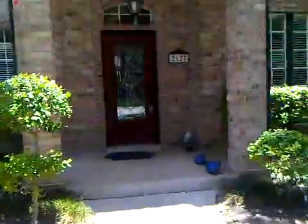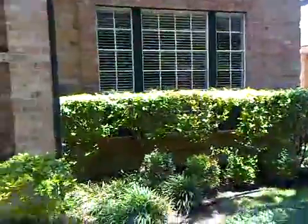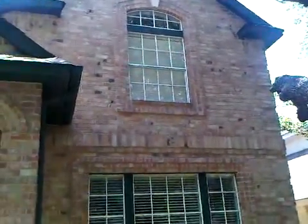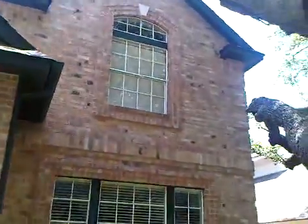Coming over here on the front door is brick mold. Nothing really we can do. It doesn't really need to be replaced, just maybe paint and seal it. These windows, we have two supports here that are wood that are rotting, so we can replace that with Hardie. Same thing between the bottom window and the transom piece, we have this little horizontal bar that's wood, and it's rotten completely through, especially up in that right hand corner. So we'd replace that with Hardie board as well.